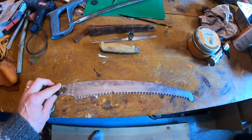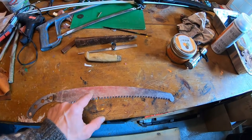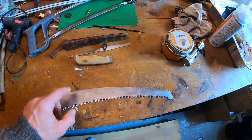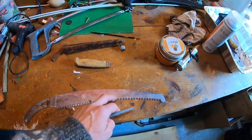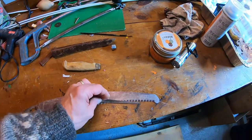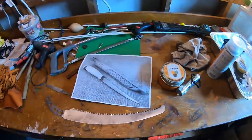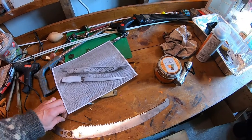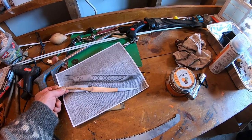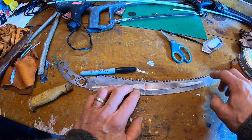Because it's taper ground, it's actually thinner at the top of the blade and thicker at the base. When you cut through a live branch — because it's soft and smushy, green wood, wet wood — it tends to close up on you when you cut. So this cuts a slightly bigger kerf on the bottom, and it's thinner at the top so it goes through more easily. Because of that, we want the top of our knife — the spine — to be closer to the teeth on this part, so that way it'll taper thinner towards the blade end, towards the sharp point. So the thick spine of the knife will be on the thicker part of the saw blade.